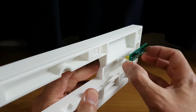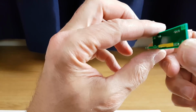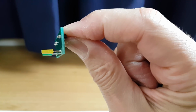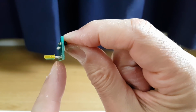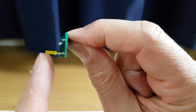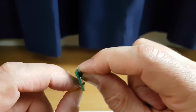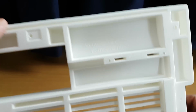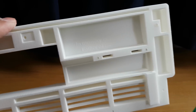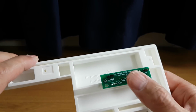What's happened is I hadn't taken into account, if you look at these LEDs, and again I do this for more education for people, if you look at this, let's go finger at this end, can you see the slight lift at the end of the plastic? I thought they would have carried on straight through, but they don't. They've got like a lip, and I literally made the holes for the size of the LED, so it was smooth, you know, as neat as possible. But of course they won't go in, so I've got to modify that.